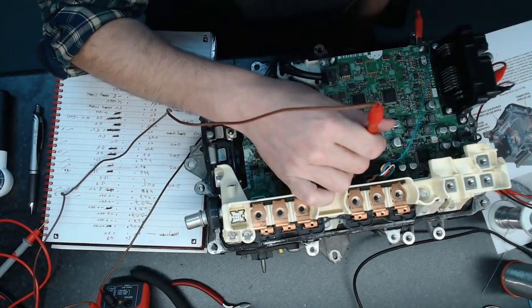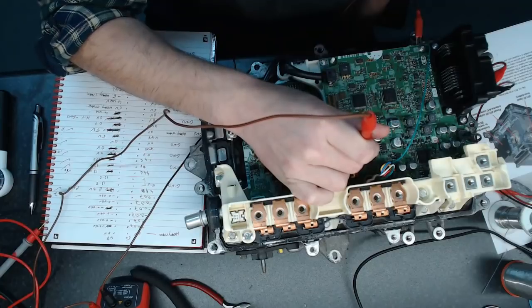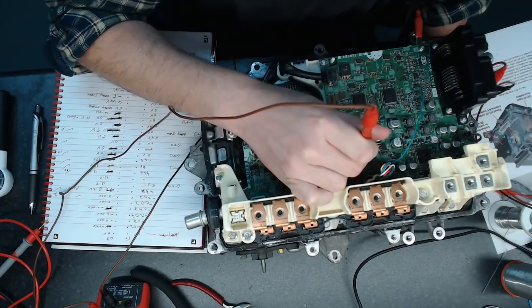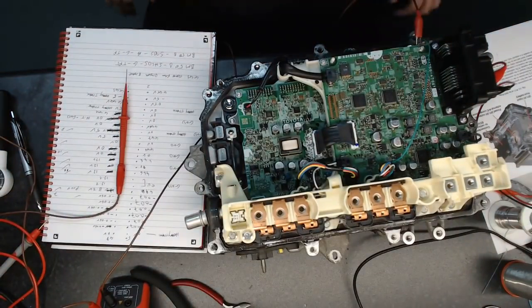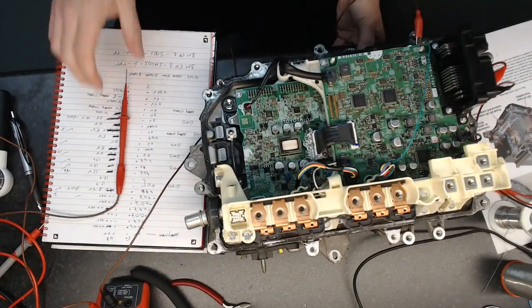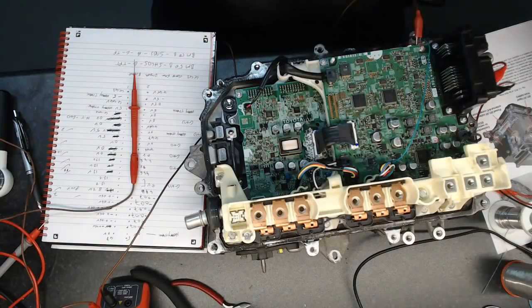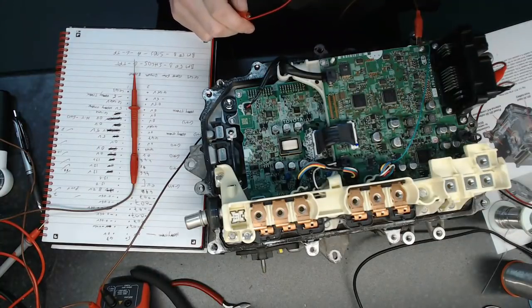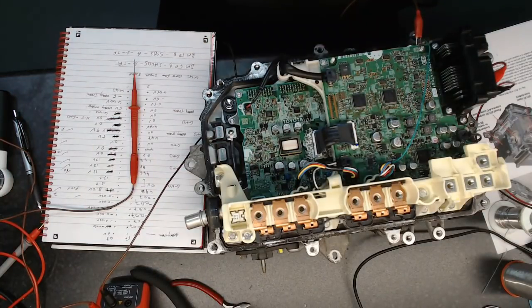That's got 5 volts on here, and this has 5 volts, so in order to turn this on, you want to pull it low, and then bring 5 volts onto this guy here. So let's see if we can help it with that shaft, shall we? Turn off the gas here. A little less noisy. Alright, so let's help it out. What am I going to do? Am I going to pull this low and turn on the transistor? Well, that's one way to do it. Let's get a piece of wire.